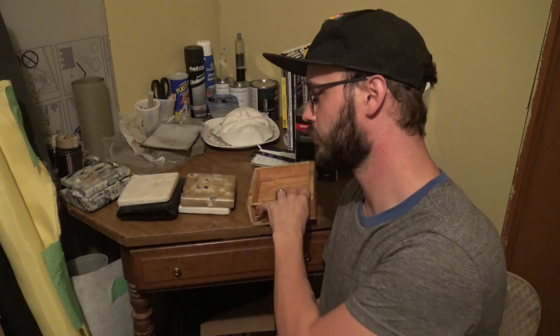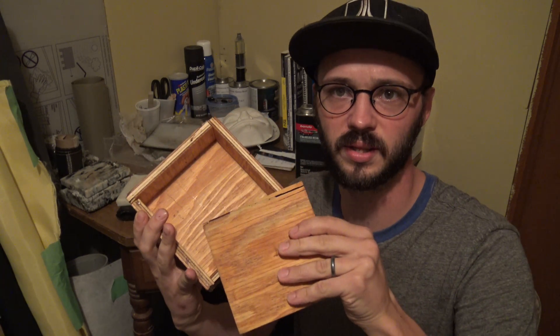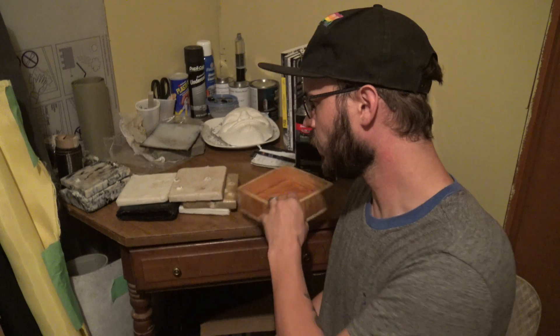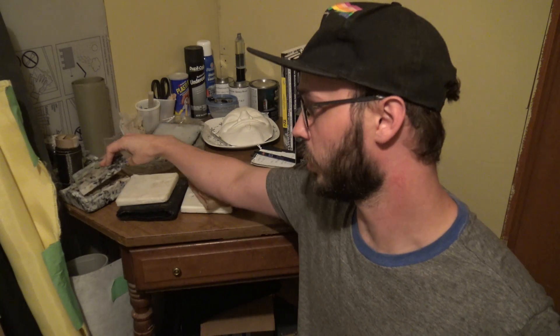It's very simple and pretty straightforward. I made this crude wooden mold — it's five by five, a few inches deep because I didn't know exactly the thickness I wanted for my plates initially. I ended up going with a half a pound of chopped up milk jugs, which roughly came out to about five milk jugs per plate. I made up a bunch of different ones, some of them with nylon paracord, which I'll go over in this video — it didn't work as well as I had hoped. So I went a different direction with wrapping the fabric, which is the simple lamination I did with these.